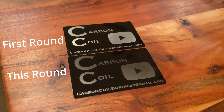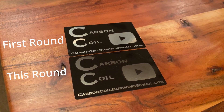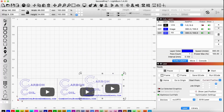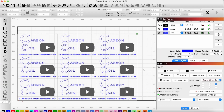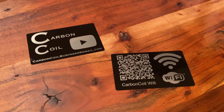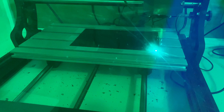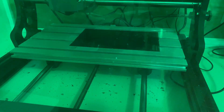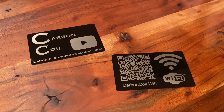The 4 cards from this round of engraving turned out a little less shiny than my first attempt, but I'm not sure why. In any case, now I have a set of 5 business cards, and I could even fit up to 9 cards on my laser machine at once. Once you get the power and speed settings dialed in, engraving anodized aluminum is pretty much like any other laser cutter project. Armed with the knowledge from this tutorial, I'd love to hear what you're planning on making in the comments down below. Thank you for watching, and I'll catch you in the next video.